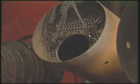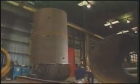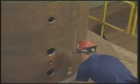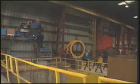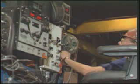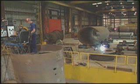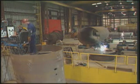After the matchboard tube sheets are positioned and tacked in place, the shell is then delivered to the specifically designed welding pit. The shell assembly is aligned onto one of 3 turntables depending on shell size. From this position, the welders maneuver the robotic welding arm into position above the shell. The operator rotates the vessel assembly under the welding apparatus. Again, all welds required for pressure vessel assembly are completed in the vertical down position.